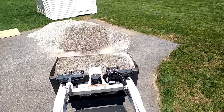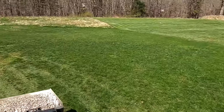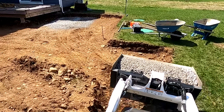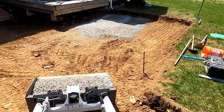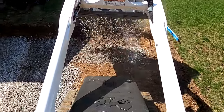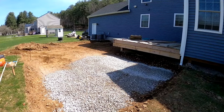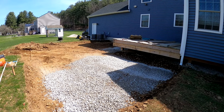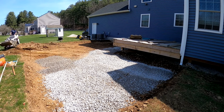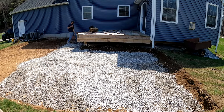What about clay soil types? Even with a clay soil type, water will still permeate through, but at a much slower rate. When doing an open grade base with a clay subsoil, what we end up doing is digging it deeper — digging deeper gives you more volume, more space in your base for water to collect and permeate down into your subsoil. If you remove the clay and put stone in, the customer will never be worse off than before, because all you're doing is giving them a huge dry well area for water to slowly permeate down. With clay we dig a little deeper and do a little more compacting to make sure it's steady. This job has really good gravel and stone-like subsoil, so there will never be any water issues here.